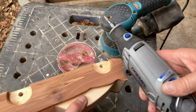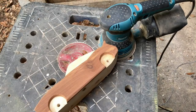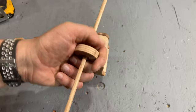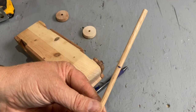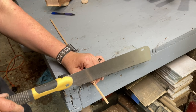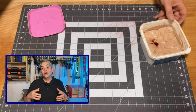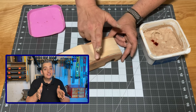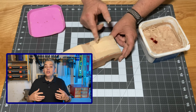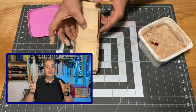Then it was back for more sanding. I also used a dremel to bevel the hard to reach areas like the wheel wells. Originally I wasn't planning on adding the cedar on the sides of this car, so when I sanded the 2x4 form I put little bevels on the edges. When I actually added the cedar on the sides, it left little visible seams between the cedar and the 2x4 form. Wood putty doesn't take finishes very well and I really wanted to keep this car natural wood, but in the end the seam was bothering me too bad, so I decided to go ahead and wood putty it anyway.